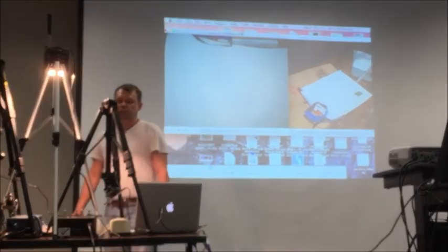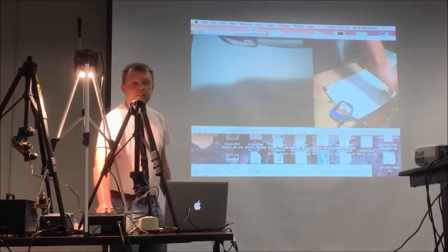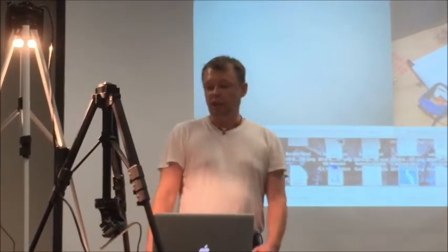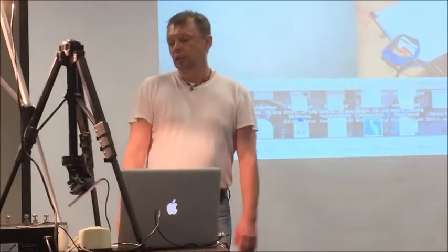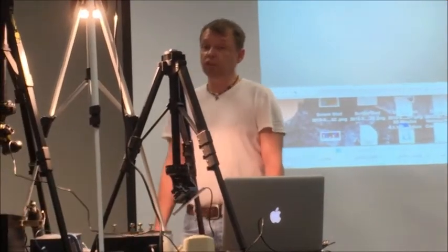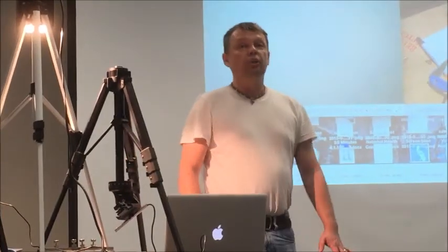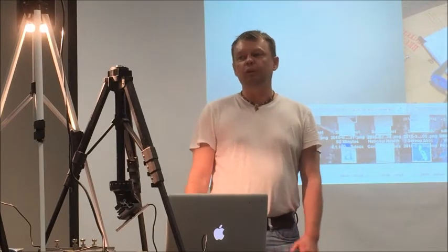Another tool which is good to have is a preheater. Again, I showed it last time, I'm not gonna show it again. I will show it in action. This is very good for boards with a little bit more delicate components. If we have time, I will show you what will happen if you try to solder the electrolytic capacitor just with hot air.